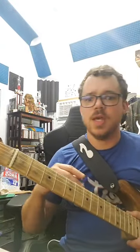Sanded down to 600 grit on the back. But the other thing I did was when I did the frets, when I leveled and dressed them, all that, I did not protect the fingerboard at all, which immediately makes the fingerboard look ancient. So it has all those oils and all the gunk from when you're sanding the frets and everything, and so it immediately makes the neck look like it's a million years old.